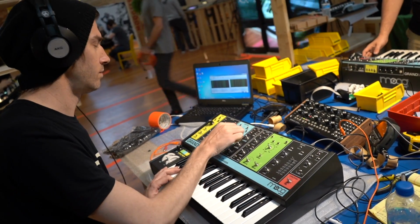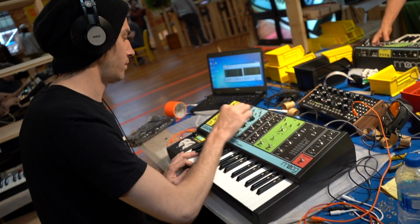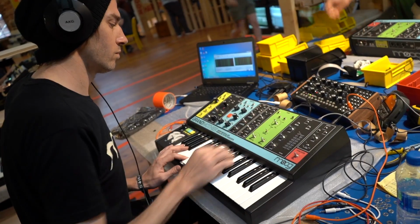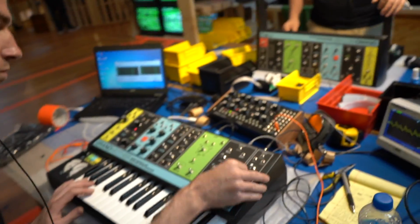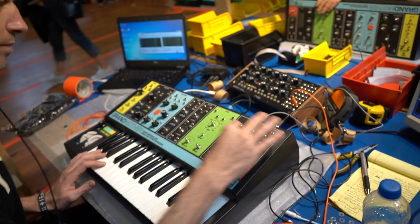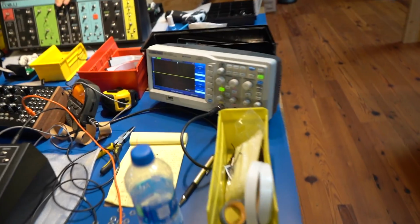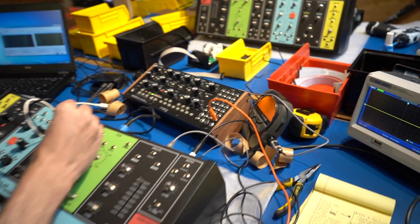After the 24-hour burn-in process, the synthesizer is brought to Station 4. This is where we perform our final listening check. Every major function that the instrument is designed to perform will have a human being step through those processes to ensure that not only is the performance correct, but that the experience of interacting with the instrument is perfect as well. So at Station 4, they're going to use oscilloscopes and multimeters and different measuring devices to be able to see what's going on inside the circuit.